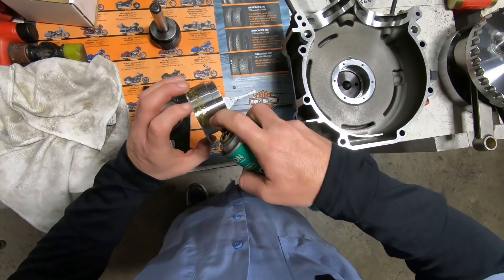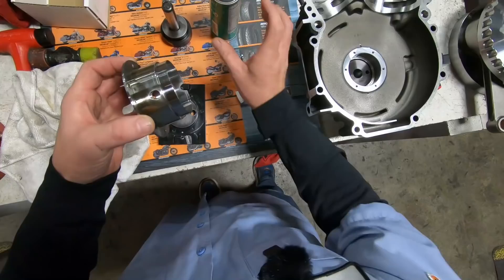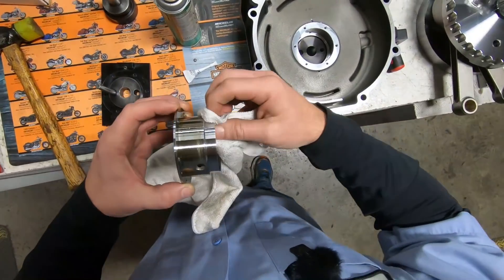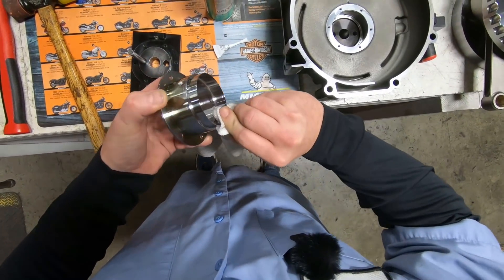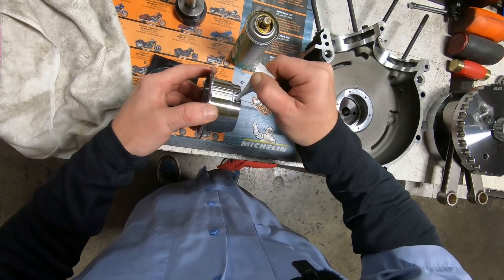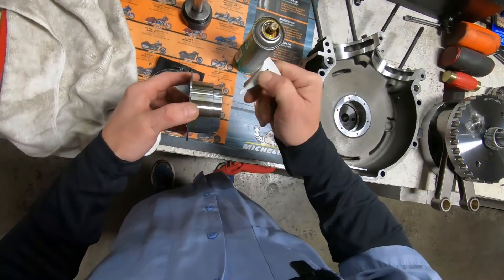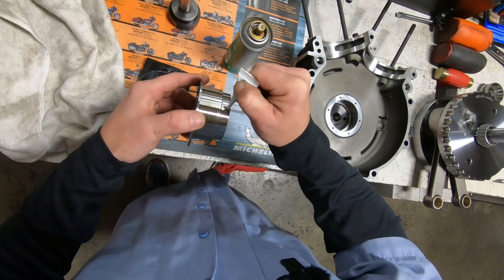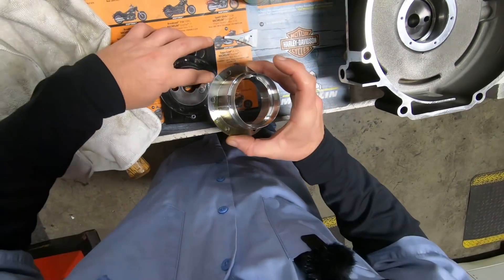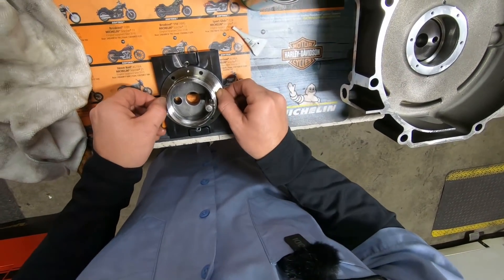This is press fit lubricant on this area here. We want to make sure not to get any of this on this area here — this is where our bearing retainer compound will go. You don't have to use too much of this stuff; it's extremely strong and goes a long way. What comes in the kit is plenty to do the sleeve and also all the screws that secure it in place. You have to be careful — there's a locating pin right there and one that mates up right there. You want to make sure you're seated inside that locating pin.